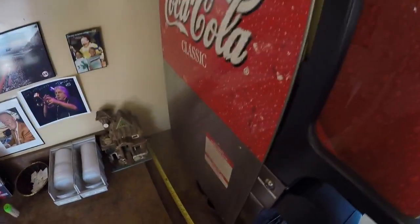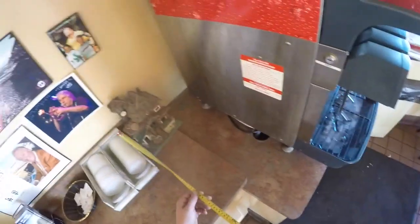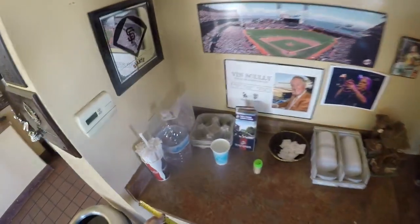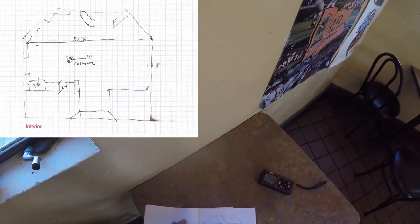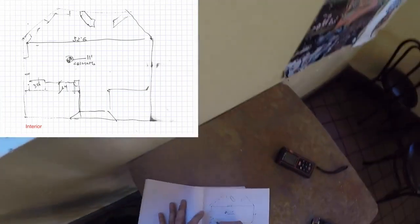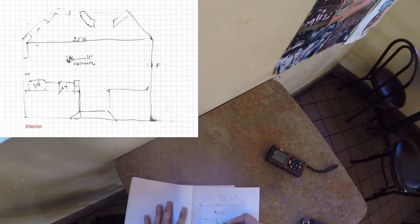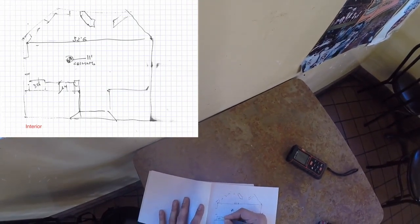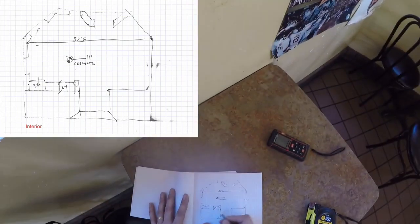You know, you wanna get countertops. Don't get too much detail, but you know, you need to know, okay, that's 34 inches deep. This one changes over here, like that. It's less deep, shifts that way. You measure this stuff like that and you draw it in your plan. And you're gonna have multiple drawings with all these little details in them. And you're gonna break out, say like, okay, look at this counter over here. It's like this and this. There's a little wing wall that comes out like that, right? And I'm gonna know, all right, that's 24, that's 38, or whatever it was, right?